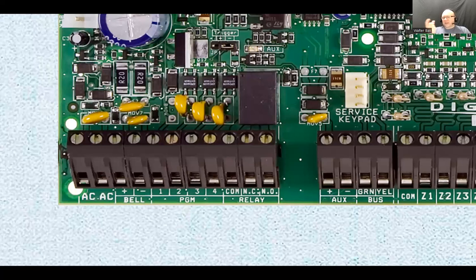And on the other side, there are screw terminals to which you can connect a wire, and usually it would be a stranded 18 gauge, sometimes 16 gauge pair or conductor. Sometimes it's mistakenly labeled as a speaker wire, right? But it's about 18-2, which is 18 gauge, or 16 gauge is okay too. And you just plug in here, and that's it.